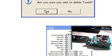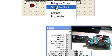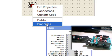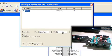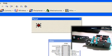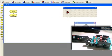Let's get an LED in our code — we won't need the default stuff, so let's delete that. I have the full version of Flow Code, not the demo version, which always brings that up. We want to delete that and connect our single LED. By default it comes on Port A — we're going to move that to Port B, specifically RB2, which is the first LED on the shield.